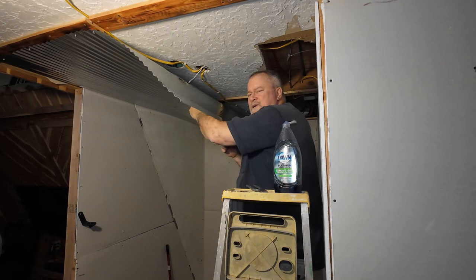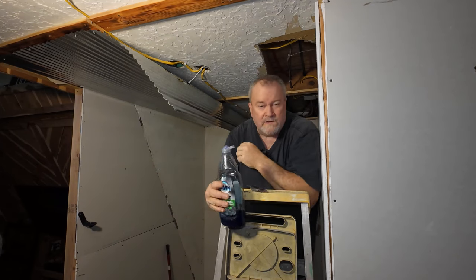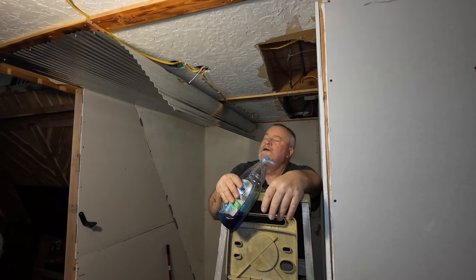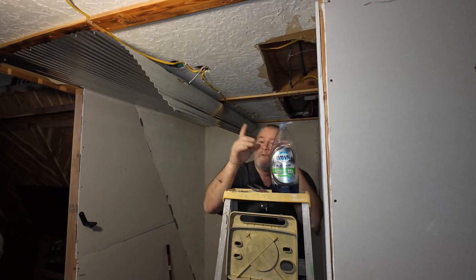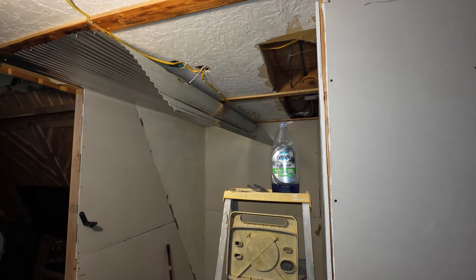See, guys, I might have struggles, but I'll come up with it. The answer: a little soap on the grommet. Soap dries up, won't come back through. All right, you get the point. Let me get this piece up, feed the dogs that are going nuts, and then I'll come back and we'll hang these lights. This is taking up my whole day, but it's gotta get done right.